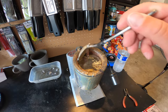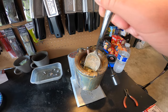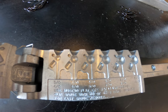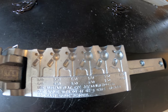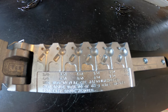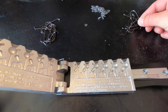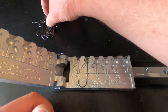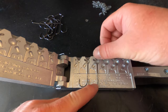The lead is nice and hot already, so we're going to make sure it's all clean — everything's off the top, which it pretty much is — and we're ready to go. Just like all other Do-It molds, everything is nicely labeled on here, which makes the process really simple. This mold can make from a sixteenth all the way up to three-eighths ounce. For the eighth ounce, we use the 3/0 hook, and the 4/0 hook goes into the three-sixteenth ounce slot.